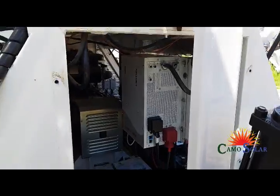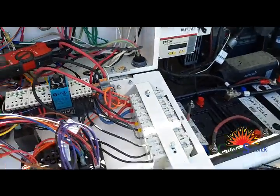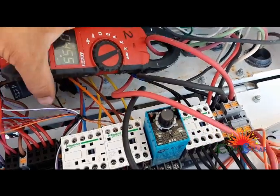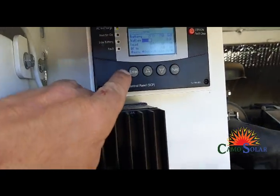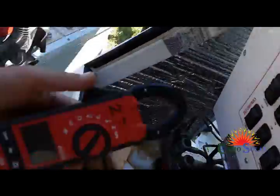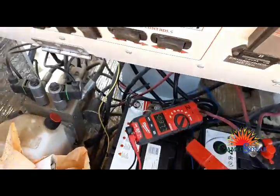I've got to hook the temperature monitors up so it'll change the charge algorithm based on temperature. Every system I work on, I try to hook a meter up and see how many amps we're pulling from the generator. I'm pulling 45 amps on the red wire and 35 amps on the black wire from the generator. That power is going to the inverter operating as a charger — it's pulling 20 amps and charging 74 amps into the battery. The IOTAs back there are charging about 37 amps into the battery.